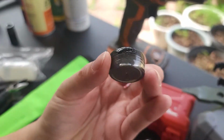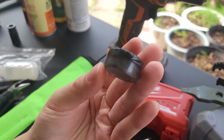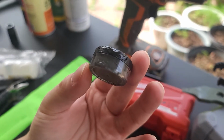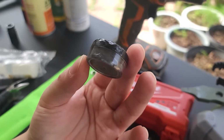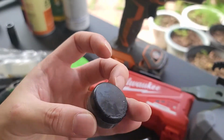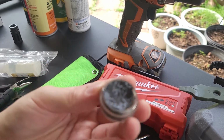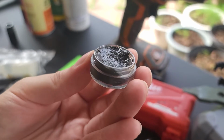And the other thing I think is important for every gunsmith to have is lithium grease. Now, this I use to apply to the larger nut on the AR barrel, and maybe some other parts too. It's a lithium grease. It doesn't bind up when you shoot a lot, so your barrel doesn't bind to your upper receiver and stuff like that.